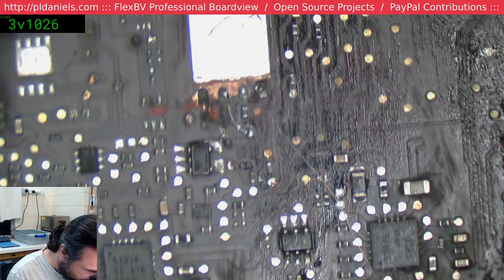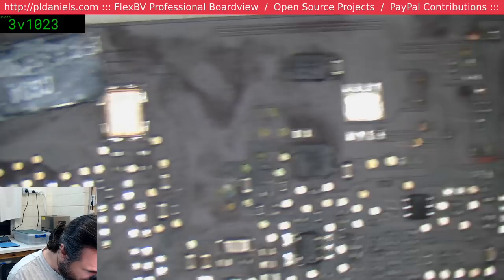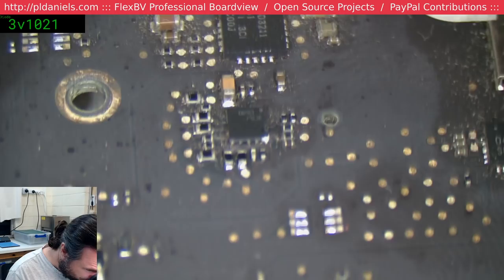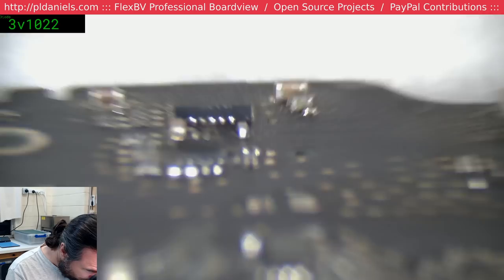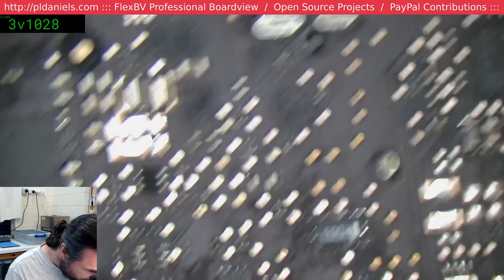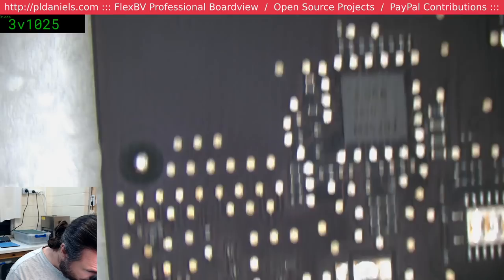Yeah. Holy crap. Alright, so this... Oh, man. I'm not actually complaining, really. I enjoy this sort of a challenge. So what we've got here is a cluster job. It's not that bad. It's not that bad. Backlight ball's good. So we just got a bunch of nasty corrosion got picked up. Wiped out the BIOS traces. Looks like it's taken out something next to it. I'll get back to that in a second. I just want to do my big overhaul.